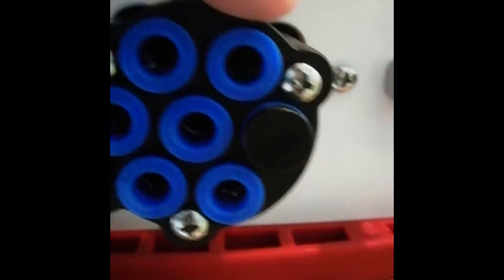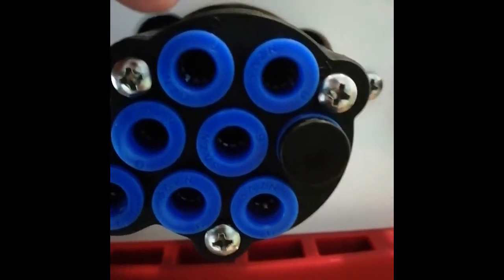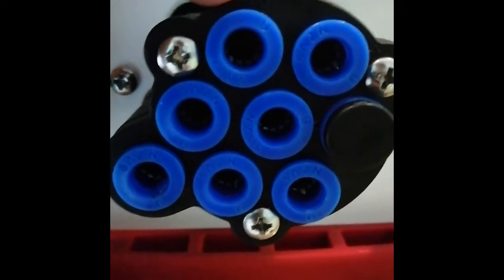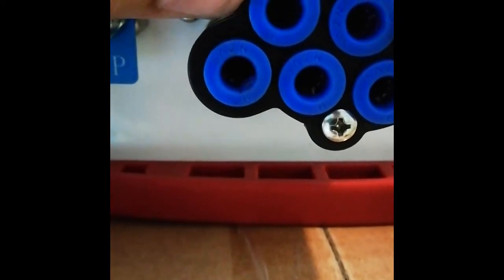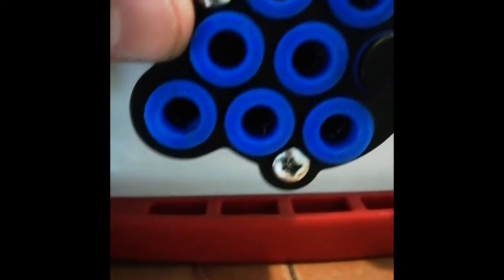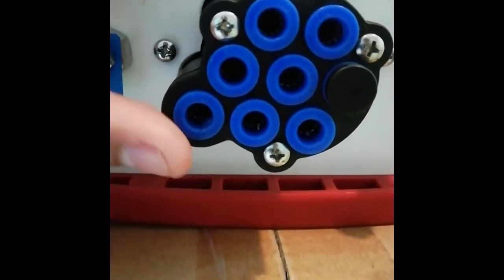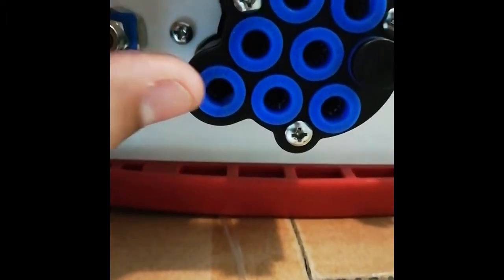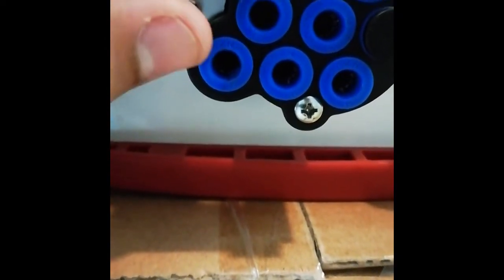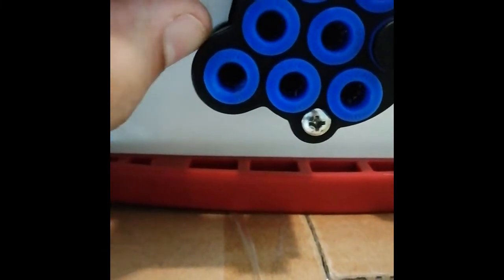So for the first backwash valve, put it in the port labeled with number 2, and for the second backwash valve, just insert the tubing into port number 3, and for backwash valve number 3, put the tubing into port number 4, and so on. There is one port here that protrudes a bit from the others. This one is for the inlet pressure, if you are using water, and also for the air pressure.